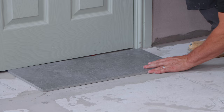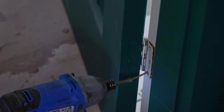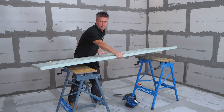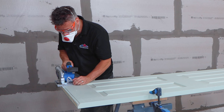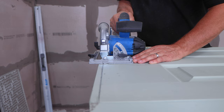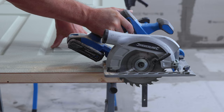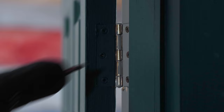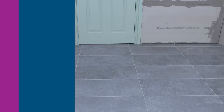I'm going to show you how to cut and plane down the bottom of your door if it's catching your floor. Start by finding your level — place two tiles on the floor and put them up to the bottom of the door, take a pencil and strike a line across the top of the second tile. Remove the door by unscrewing the hinges out of the frame. You'll need to cut the bottom of this off — lay your door on two workbenches and clamp it down both ends. Make your line more noticeable by drawing over it again, then cut it off using a battery-operated circular saw, or just a hand saw if you haven't got one. Then using a small orbital sander, sand the cut edges to remove any splinters. Refit the door, check that it clears your two tiles — if you're happy with that, you can start to tile your floor.